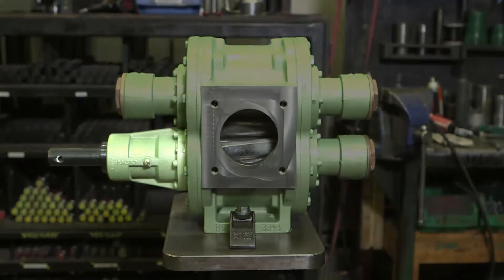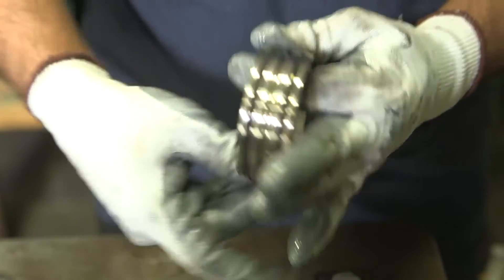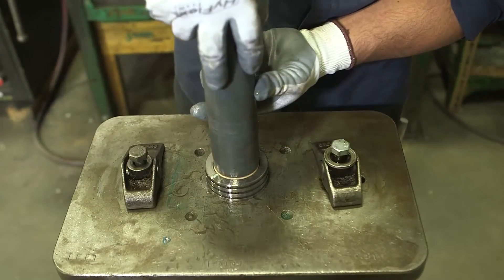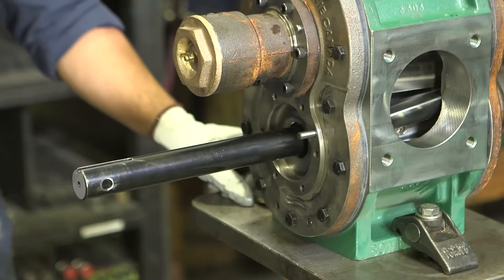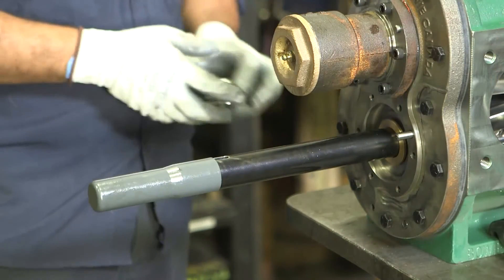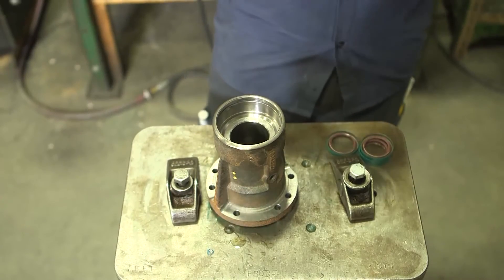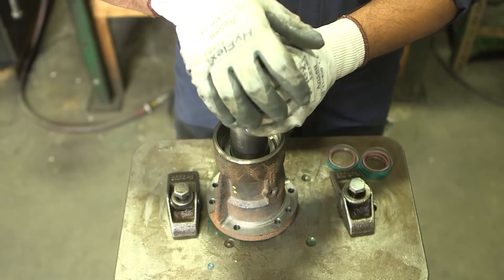Now all we have to do is assemble the large drive end cap. To begin, grease and install three O-rings into the O-ring grooves on the outside of the drive seal housing. Using the seal installer, press two high performance double lip seals into the inside of the drive seal housing so they are flush with the end. The lips of both seals must face the rear of the housing. Insert two dowel pins into the end plate. Slide the bronze spacer onto the drive shaft with the flattened side facing the outside of the pump. Place a Bowie lip seal sleeve over the shaft and gently slip the drive seal housing onto the gear shaft with the lips of the seal facing the housing of the pump.